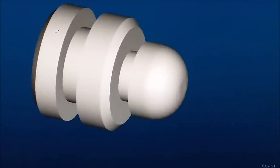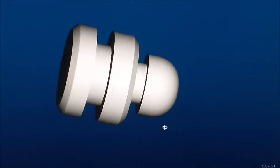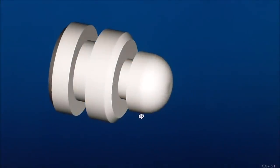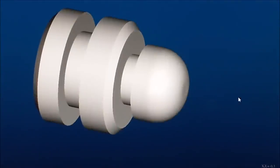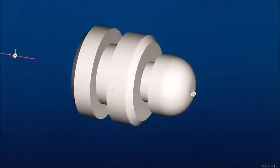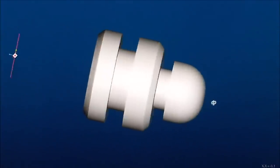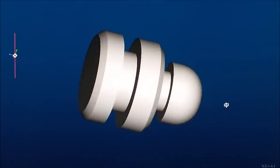And if I didn't already say the nose radius, well, the nose radius you can see, and it will be a very specific length. I'm going to show you how to allow your absolute and incremental buttons on your digital to communicate with each other, just like programming a CNC machine. If you have a newer digital that has a T1, T2, T3 position, well, I guess that's your benefit. And if you don't, I'm going to show you how I get around that, because the digital on my machine only has a Z-axis readout, carriage readout. That's it. I don't have a cross-slide readout. I don't have anything else, just the carriage.